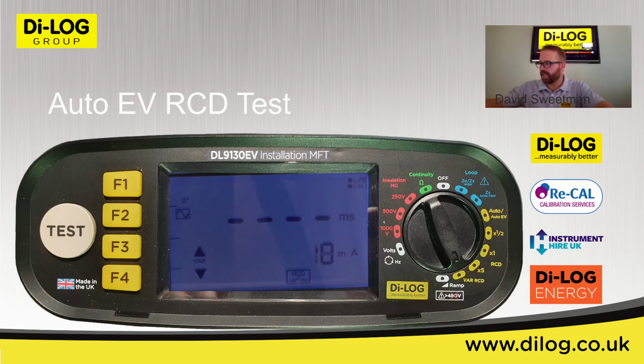And the last function we've introduced onto the new range of testers is variable RCD test as well. So you can see by pressing function 3 and 4, you can actually scroll up and down and set your parameters. So once variable RCD is set, you can jump to this preset test parameter from any of the other tests. So you could be on 1 times test, press F3 and it'll jump straight into 33 milliamp RCD or 68 milliamp RCD, however you want to do it. You can pre-program whatever you want. So sometimes you've got European spec RCDs which may require a 50 milliamp test. You can do that, and if you want to do a 5 times test based on that, you can do a 250 milliamp test. It's absolutely fine.